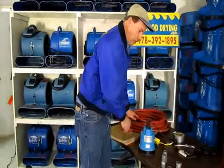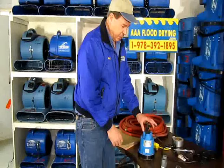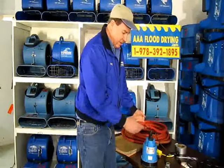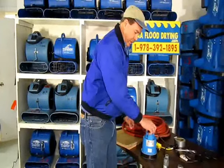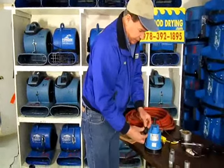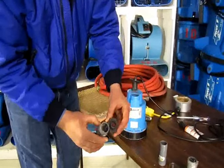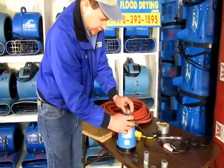Something that allows you to pump a lot more water than a garden hose is to put sump pump hose on this pump. It will pump four to six times as much water as a garden hose, and that's really handy because if you have to remove a lot of water, instead of adding more pumps all you have to do is put a bigger hose on this pump. You take out the smaller fitting and put in a larger fitting — you can see the size difference in the hole. That will allow you to pump a lot more water than just a garden hose.